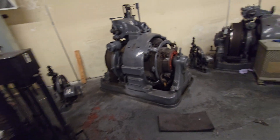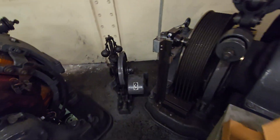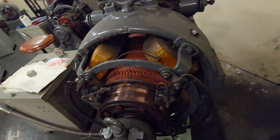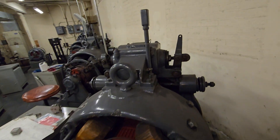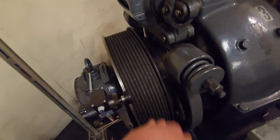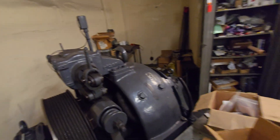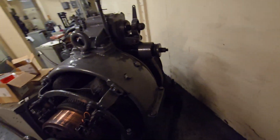We're not really going to get any action, but let's take a look at the main ones. Here is your transformer, and more transformers. Safety governors — these are some really old governors. Look at them — these are the fly-ball style governors, completely original. This is the motor: your commutator, brushes in there, armature, field windings. Brakes right here. That's how it tracks the speed — it's added on for the new controllers from the 80s. Most places would have modded them another time by now. That it's fully original is really cool.